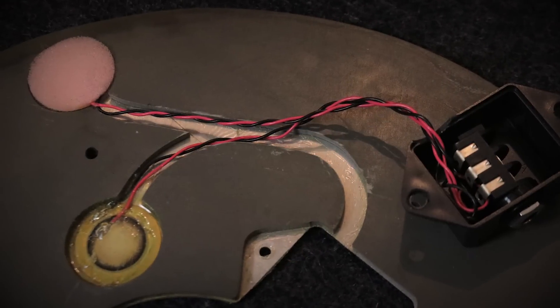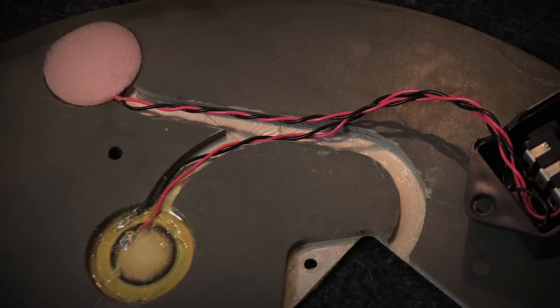This is a little bit different than a VH11, VH10, VH12, or VH13 from Roland. I was expecting a switch going around the edge of the cymbal and then just one piezo for the bow area. Because the sensors are different from a Roland cymbal, you might need to change some settings when you plug this into a TD50 or a TD11.